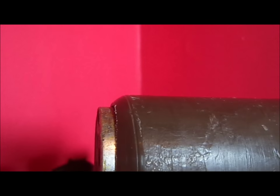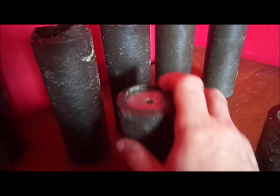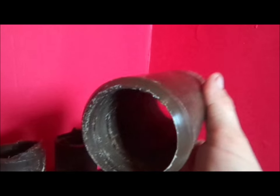But the best cutting and the best fidelity is between 85 to 100 degrees for the area, the air temperature around your blank. So this is a trimmed blank. So that's what they look like, the size of them. Right now, that's about 2.3 inches in diameter. And you'll notice the inside has the spiral core like an original Edison blank does.